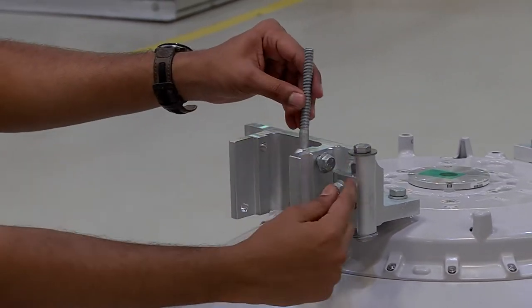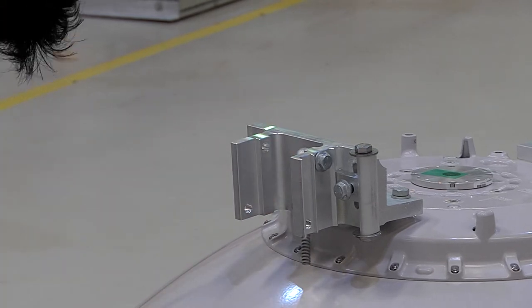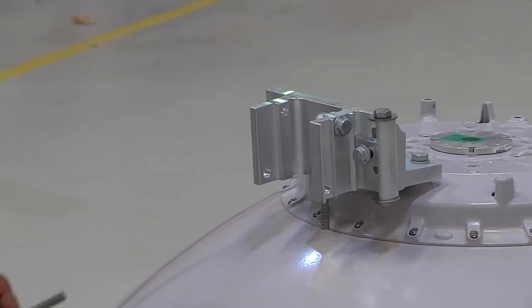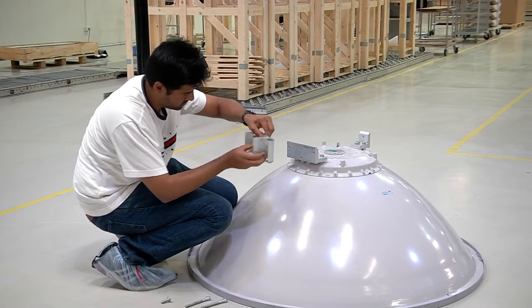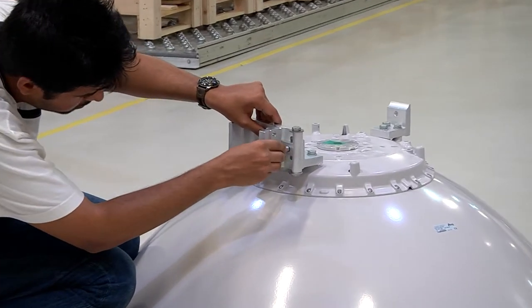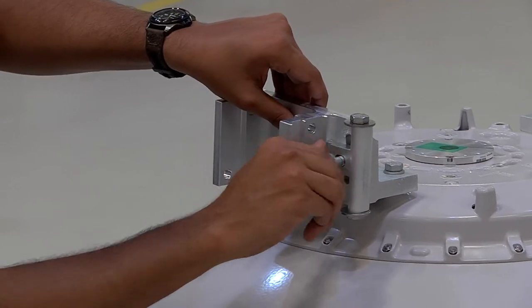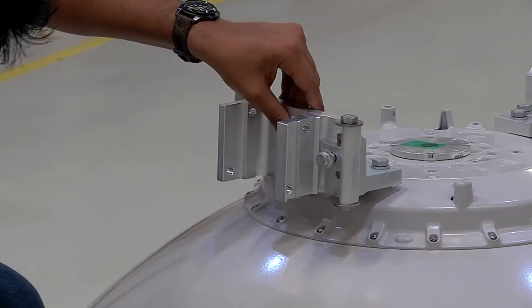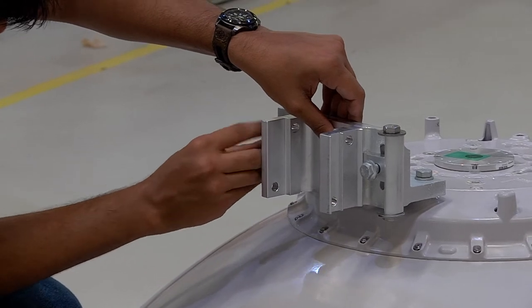This is followed by mounting the M10 link screws to the pivot bracket using a 1+1 piece of M10x30 screws. The screws are again fit loosely. This step is being demonstrated once again. It must be ensured that the pivot bracket is aligned with the angle brackets. All the screws are first to be fit loosely.